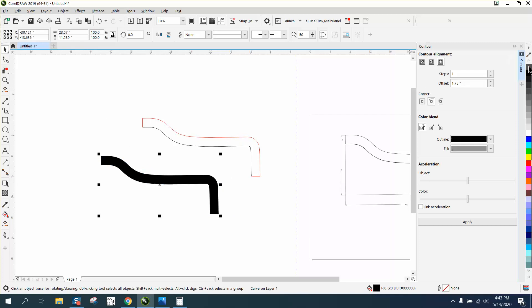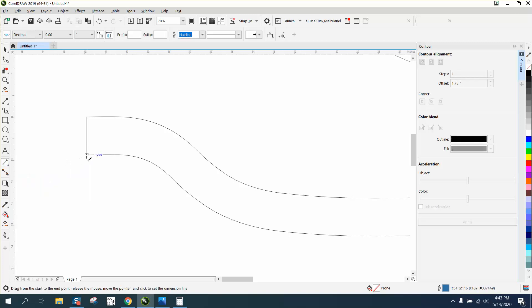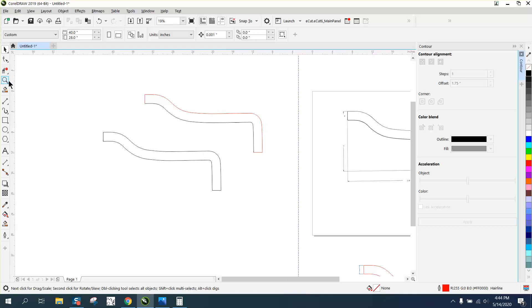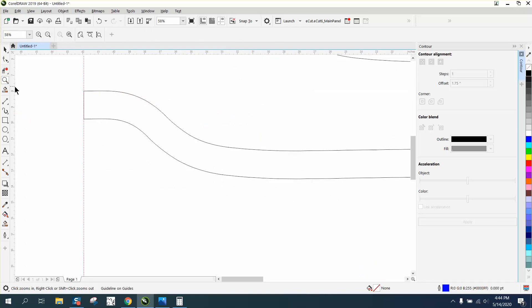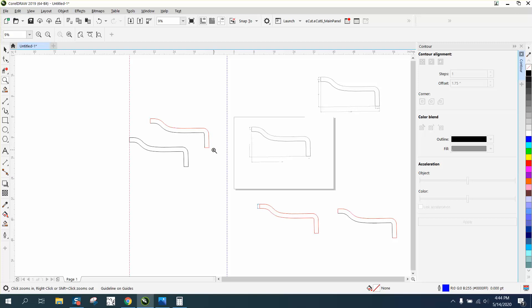Now it is still not perfect, because it needs to be 23.625 inches. So with this locked, we're going to just type in 23.625 — now it's to the right length. Let's check our 1.75: parallel dimension tool from that node to that node, and we're 1.75. It looks oddly not at a right angle here, and I don't know, because I used the Control button to hold that down. Let's just look at it — bring in an indexing line — and it might be just an optical illusion, because it's pretty much dead on. Anyway, that's how I would do it. Hope that helped a little bit, and thank you for watching.